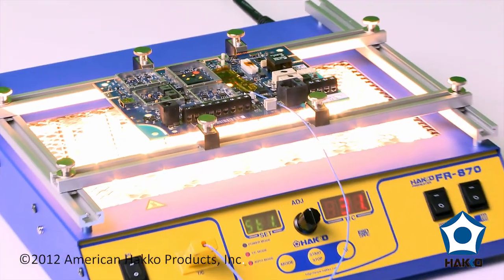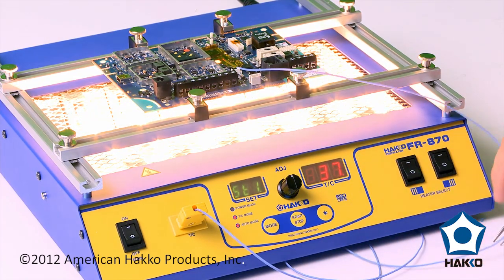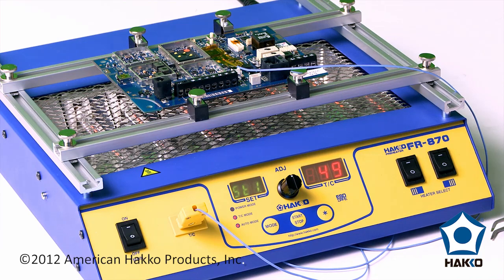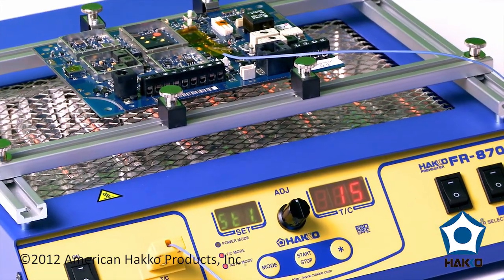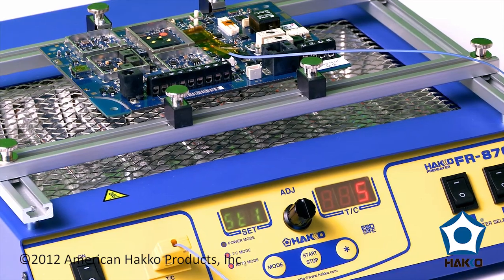You can see we've got ST1 for my first stage. The lamps have come on and we're starting to preheat the board. The thermocouple is reading the temperature — we're at 39°C, 40°C, going up. Remember, our target was 50°C. You'll notice the lamps are starting to flicker and dim because the system is realizing it's approaching that temperature. Once it hits the 50°C mark, the timer starts counting down from 30 seconds, which is what we programmed. The onboard microcomputer will maintain that target temperature of 50°C for the 30 seconds.